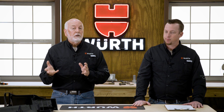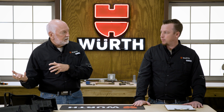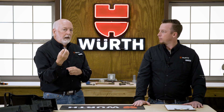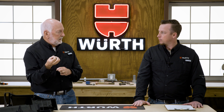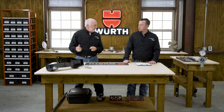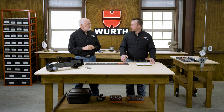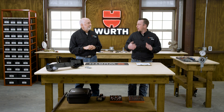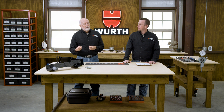Tri-roundular screws work well in softer plastics but not so well in stiffer plastics. Eventually we evolved into higher-performance thin-thread screws, getting away from that 60-degree flank angle on the regular sheet metal screw. For plastic screws used in plastic assemblies, you have a 30-degree flank angle — a very thin thread. The whole idea behind thinning the thread is to put less stress in the wall of the plastic, because plastics don't take stress very well.